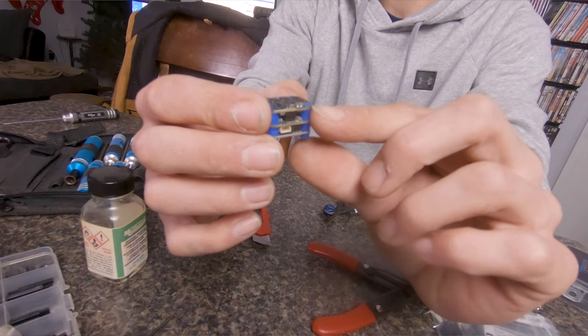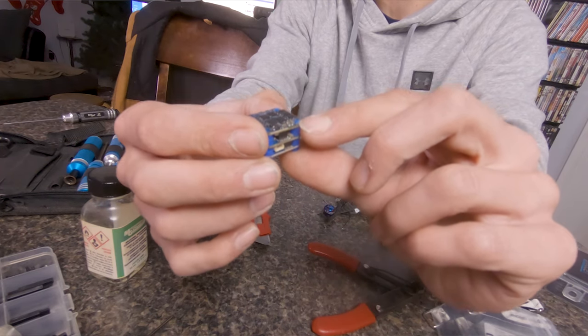What I did was cut the soft mounts on the bottom of the ESC and use an M2 nut at the very bottom of the stack instead, because that saves about a millimeter of height. As far as spacing between each board goes, you can't really go any less because of the pins that connect the boards together. Anyway, I conformal coated the bottom of the ESC - you want to conformal coat the bottom of each component before you install it, then solder your wires to the top, then conformal coat the top, then put the next layer on.